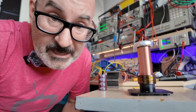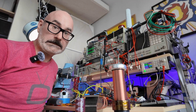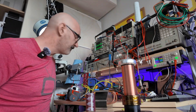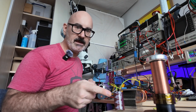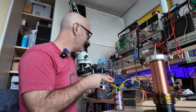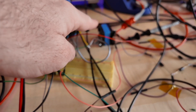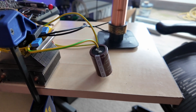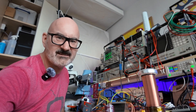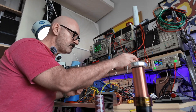Do I look scared? I am scared, for the day has come. I think I've wired everything up correctly for a full voltage run. Both MOSFETs are on these heat sinks — hopefully that'll help cool them down. So this will probably charge this big capacitor. We've got 150... 170 volts — this is AC volts coming off the transformer. 250... so we're over mains voltage now, at very high frequency. We're getting 280 volts now, which is presumably the voltage on this capacitor. This is actually now quite a dangerous capacitor. I'm going to turn up the duty a little bit, and then just switch on and off the frequency.